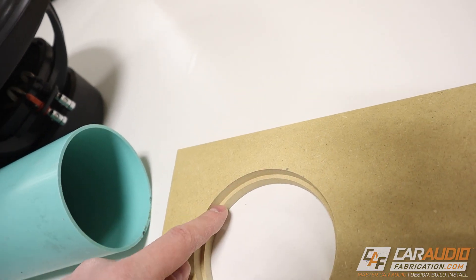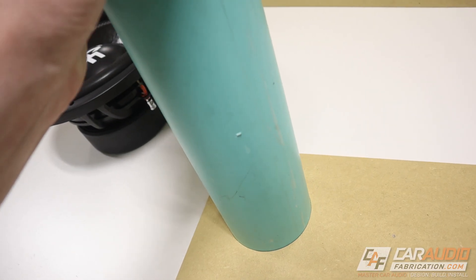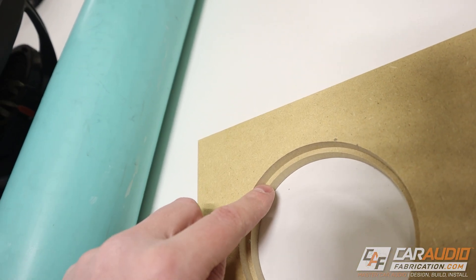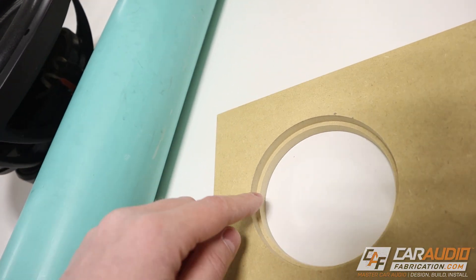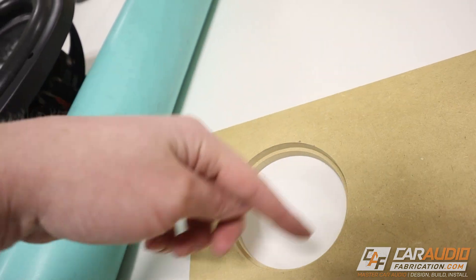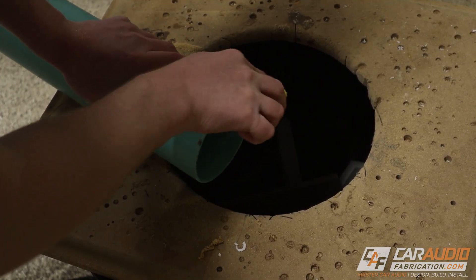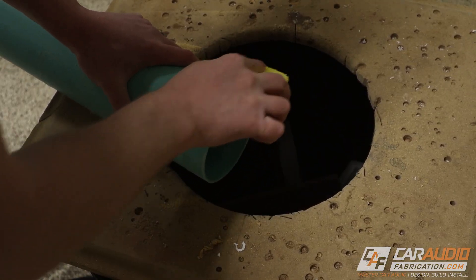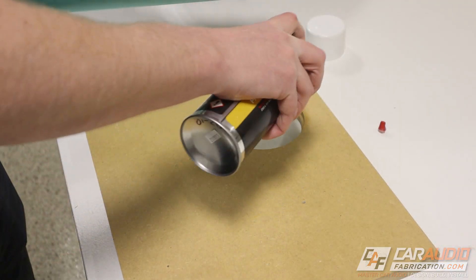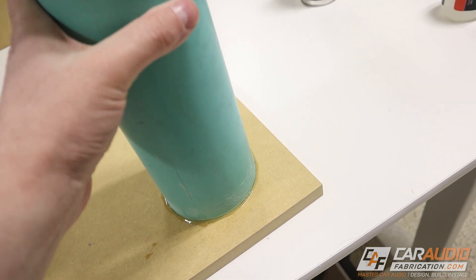Now we have that nice notch on the inside. The port fits into that first hole but won't go past the step — it sits in there looking good. Now we can apply adhesive: I'll use CA glue to bond the wood to the PVC. It will have surface area on the bottom ring as well as around the outside, giving lots of surface area. I first rough up the PVC with sandpaper for better adhesion, then carefully run a bead of CA glue around the pipe, spray activator on the wood, and attach the two together — getting a solid bead of CA glue around the outside, sealing things up.